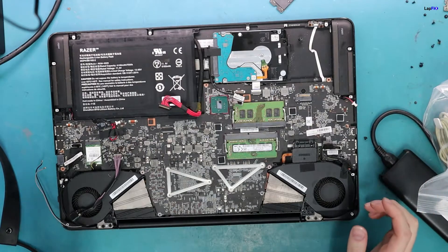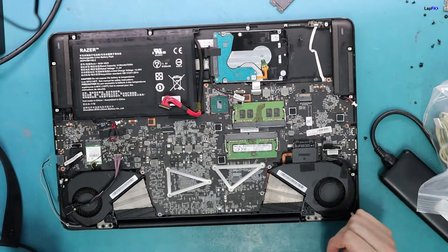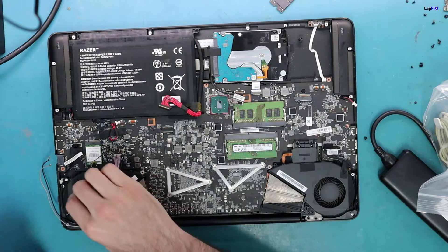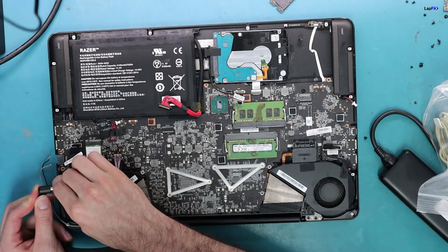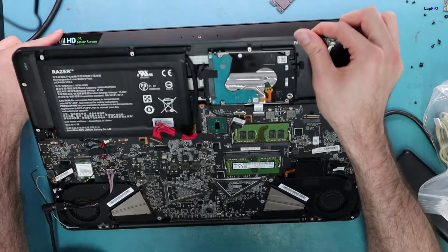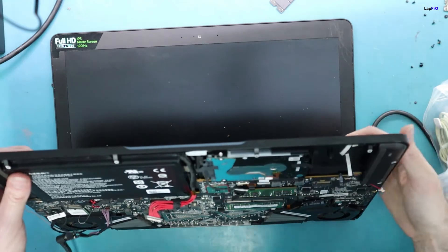Because some of the pins were a little bit damaged and further gone than they should have been, we weren't able to do this unless we removed the casing and soldered directly there. That's the best way to go about it, especially since the old one had pins that were stuck in it. This gets a direct connection going from the jack itself directly to the board. So now let's just go ahead and check it out and see if we get power. We're going to test the fruits of our labor here — we want to make sure it's all good before we fully put it back. Let's plug it in and see if we get power.